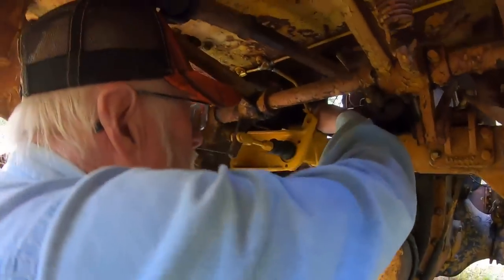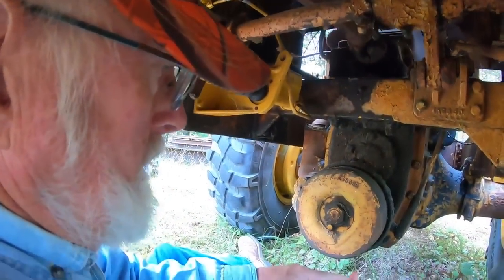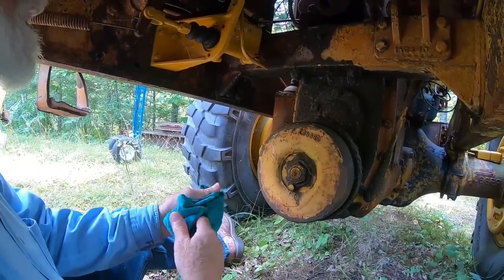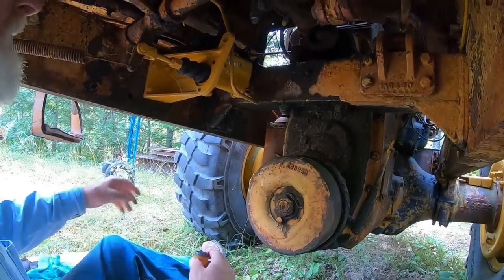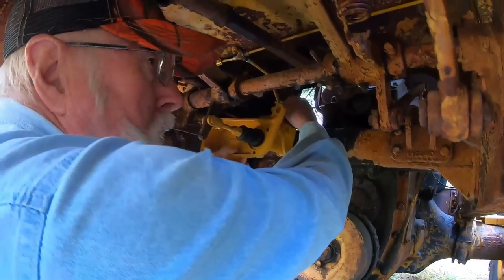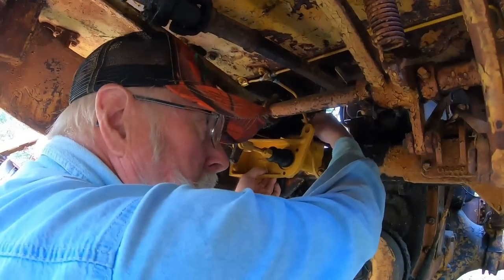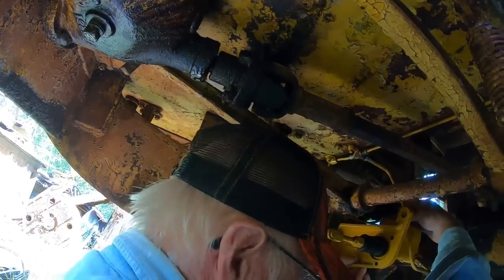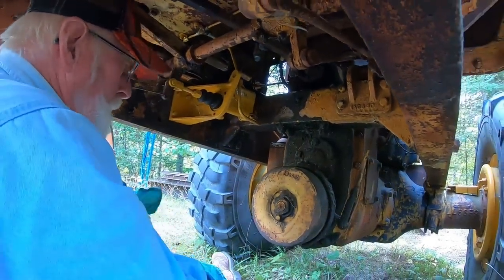How's it looking for fluid in there? Well, I'd say we're that far from the top. We should be good. Yeah, let's try a bleed out at the wheel cylinders and just make sure that we've got working brakes. Let's see if we got pedal first. Haven't tested the pedal yet. And watch your head, because right above you, it's really greasy. Oh, yeah. It's really bad. I'm just going to put that finger tight for now.